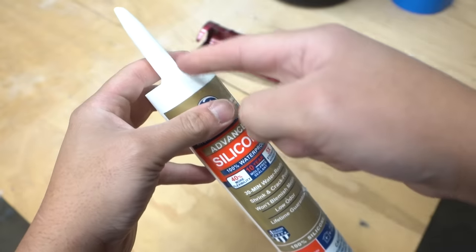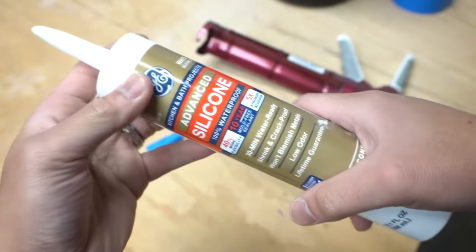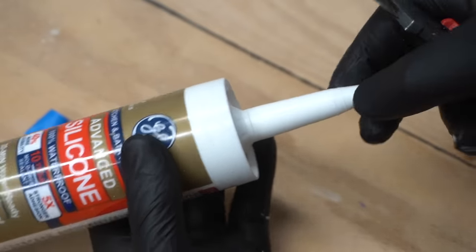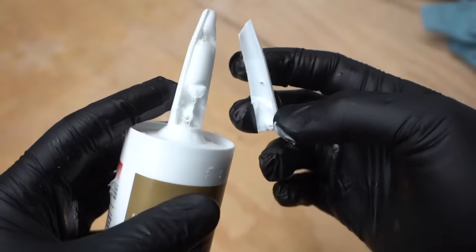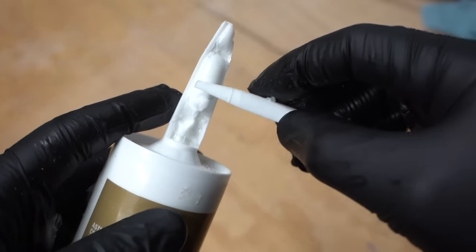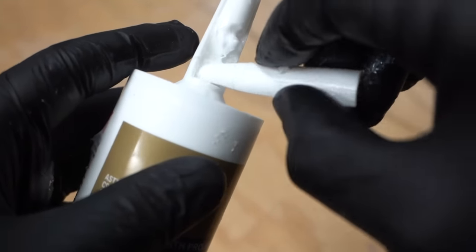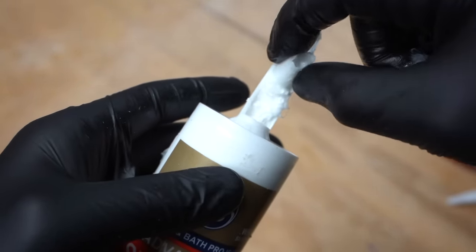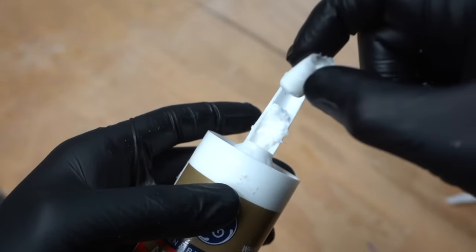What we're going to do now is slice this in half and see where the drying stopped and if the rest of it is actually dry or not. I've used this a couple of months ago so let's see how it looks. Opening this, you can see that why these caulking tubes fail is because it dries up pretty much two-thirds of the way from the whole nozzle. If we touch it right here, it still is good — this is the only part that is dry. So pretty much this tube we can actually still use if we can get this little dried part out.